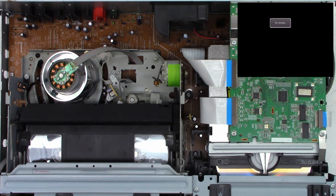So this is going to remove contaminants from the belt like that. Basically, I just fold the paper towel over it and I pull the belt through it repeatedly. And as you can see, I rotate it while I'm pulling it. So I can only apply pressure to two sides. So if I rotate it, I get the other two sides of the belt. And look at that, just brushing against the belt. And so all I'm doing is taking my acetone and just dumping it out right there onto the paper towel.